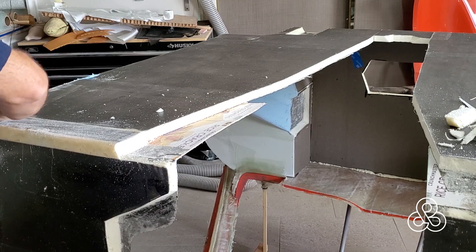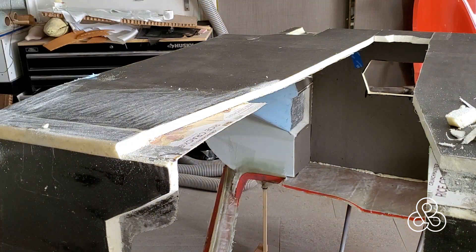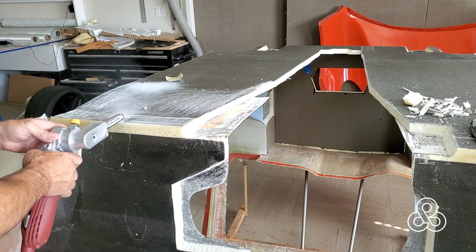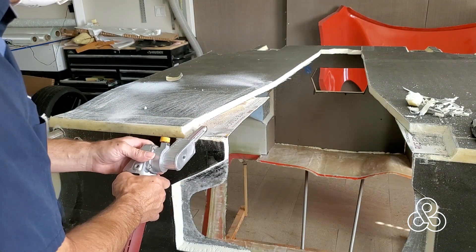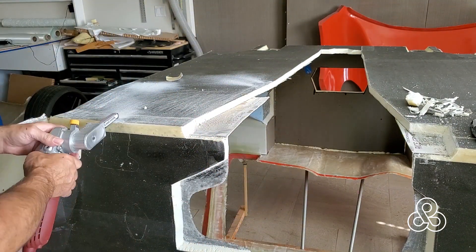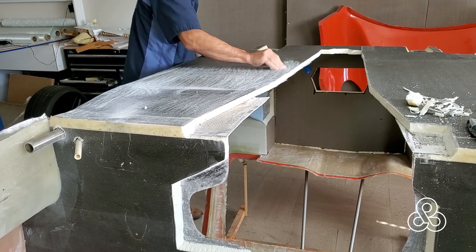To get ready for those larger sheets, I'm going to scuff up this whole surface as well while we're at it. While scuffing, I discovered some resin that had run down from laminations on the side. So I got the belt sander out and ground out those thicker pieces of resin to smooth things up. We want everything to be as smooth as possible so that our fiberglass layers lay nice and smooth against our surface.